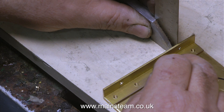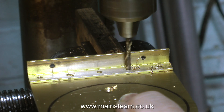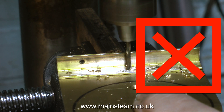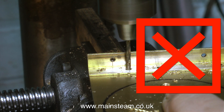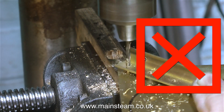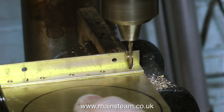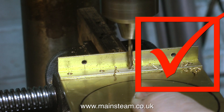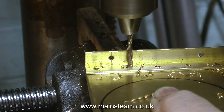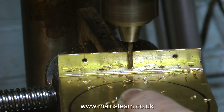After about 5 minutes the Loctite has grabbed sufficiently for me to pilot the holes. What I'm doing in this clip is doing it wrong — I'm drilling all the way through; I'm only showing the wrong way for the video. The Loctite hasn't fully cured, and the heat of the drill warms up the plate so the Loctite loses its grip. So on the second plate I will not be drilling all the way through. All I'm going to do is just spot the holes — this is the way to do it — then drill all the way through. If the piece gives way, it's okay because everything's spotted to start with.